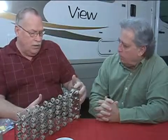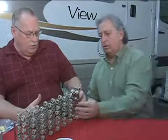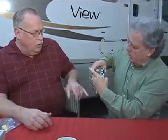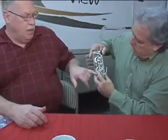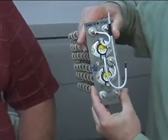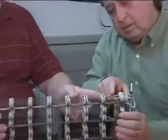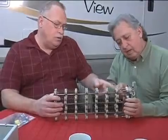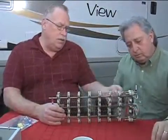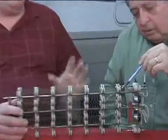This system, unlike electric plug-in heaters, has redundant safeties built in. It has two automatic high-limit temperature switches that at 200 degrees will shut the system down. And if one fails, the other one kicks in. And if those fail, there are fusible links behind the panel inside here — they look like little diodes. These things at 333 degrees internally open up and shut the system down.